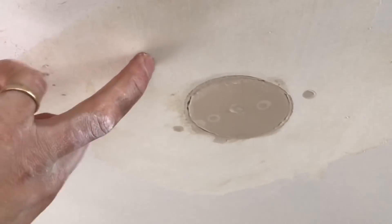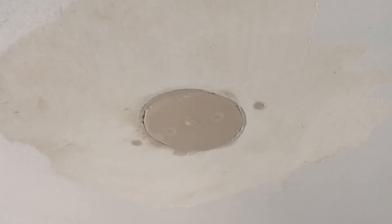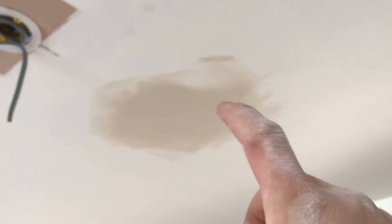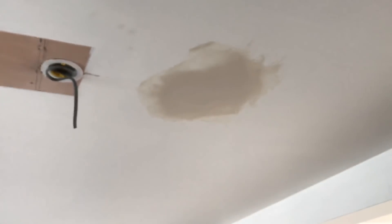I've let this go off now. This bit's gone dry, this bit's still semi-wet. As you can see, it's sort of shrunk back into the hole now, which is great. So now I can give this a final pass with my filler, and then the painter can just give that a light sand and paint it. Jobs a good one. So I've left the painter a little bit to go with. What I will do when I revisit this job on my channel, I'll show these patches when it's actually finished and show you how good they do actually look. That's how you repair a ceiling with holes in it.